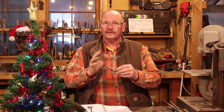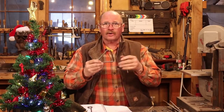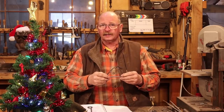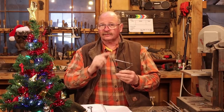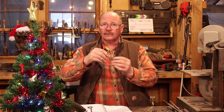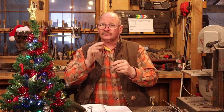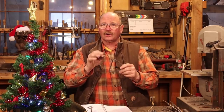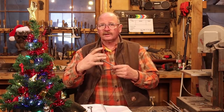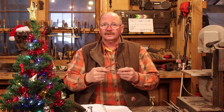As I mentioned earlier, this was one I fussed and fiddled with in the prototype stage. The main problem was simply too much heat. If you're using a gas forge like I typically do, you get long heats and thin bars get really floppy and unruly — it's hard to do controlled bends. A torch is excellent for that. If you don't have a torch and you're working in mild steel, you can quench one end just short of the bend point, then grab it with tongs and quench the other end right up short of the bend point, leaving that little quarter to half inch space hot, and then quickly bend it. In small material it cools off really fast so I still prefer the torch, but you can do it without. If you're working in a coal forge you can get shorter heats, but you may still need some selective cooling — you can also just pour water over the areas you want to cool, though that tends to make a bigger mess, especially if you have a dirt floor shop.